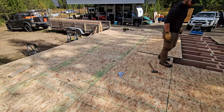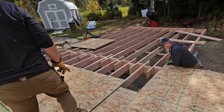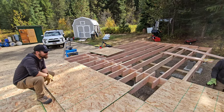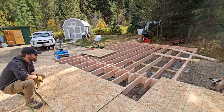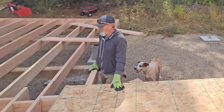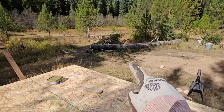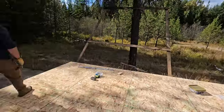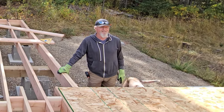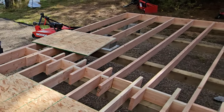We've got this much floor done and my son-in-law Jesse has come to help. This is where the bedroom meets the main cabin, and it looks like this because we made a mistake — so we're going to tell you our mistake. On the main cabin we started measuring 16 inches from this corner over, but on the bedroom we measured 16 inches from that corner over. We got lost.